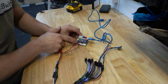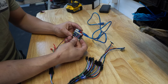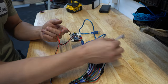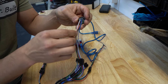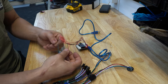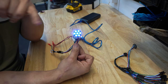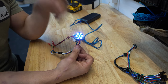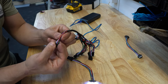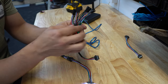Now on the CrashWorks 3D board, there is an auxiliary output — it says aux LED out — and it sends out an auxiliary LED signal wire. Out of the board I have the power out, which is the positive and negative, and then this red wire here is the auxiliary LED out. This is going to power my NeoPixels, because in order to get a NeoPixel LED to work, you have a positive, a negative, and then a signal wire — that's what this green here is, the signal wire attached to the board. Now if I power the board on just hooked up to that one aux LED, it turns on perfect, being told to turn on a set number of NeoPixels. I think I have it set to seven, but I need it to turn on a lot more. So I made a jumper harness — one power wire goes in and six power wires come out, one negative goes in and six negatives come out, one signal wire goes in and six signal wires go out.